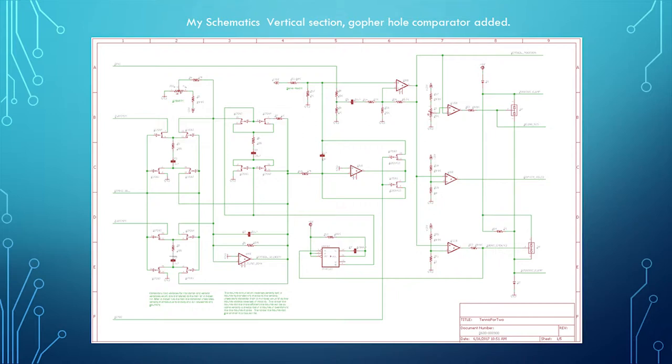Now what happens is, you know, the ball drops and eventually it hits the ground. And when it does, this circuit, this here with this capacitor, actually flips over and reverses the charge of this speed capacitor. So it goes from plus to minus at a little bit less to account for some loss in the bounce, which is adjustable. And then the ball bounces.